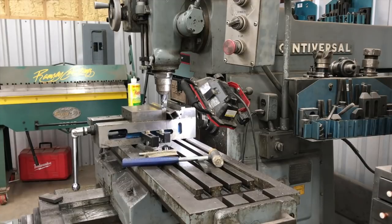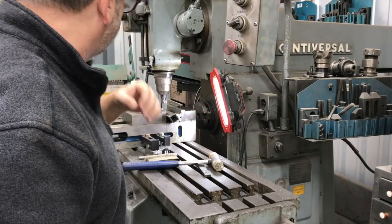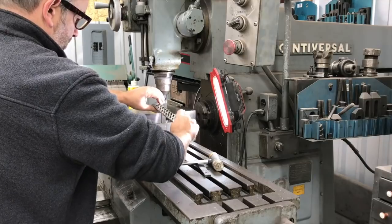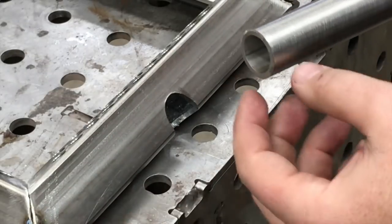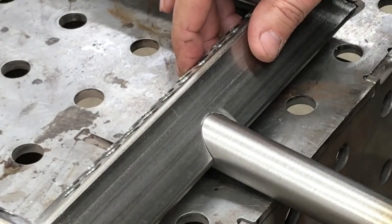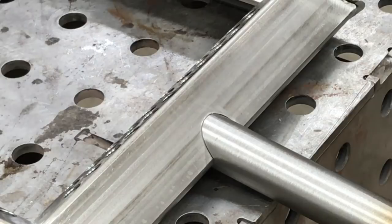Well, that was fairly uneventful — I'm not at all unhappy with how that worked out. One thing I didn't mention: I've got V-blocks in here holding this on the right 45-degree angle. Let's get it out and take a look. There's our hole. I went ahead and cleaned it up and wiped all the oil off because this is going to get welded, and I really don't want extra oil on this part. Wow, what a fit-up — it's a tiny bit loose, about 20 thousandths smaller than the one-inch end mill since the pipe was 980 thousandths, but I'm really happy with how it looks and fits.